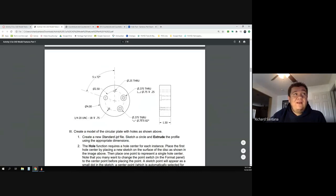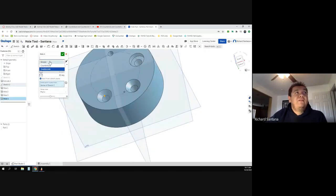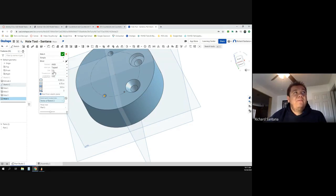So: quarter inch diameter, 20 threads per inch, three quarters of an inch deep — ignore the 1B. That symbol shows you only go down a certain depth, otherwise you'd see the word 'through.' This is a simple hole, but it's blind because it can't see all the way through. Under hole type it's not clearance — it's tapped, meaning it has threads. By default it's quarter inch, 20 TPI. If the hole were two inches long there'd be 40 threads; at three quarters of an inch it'll be 15.